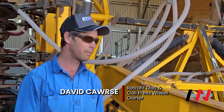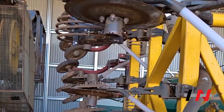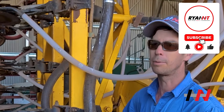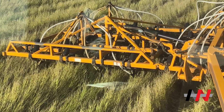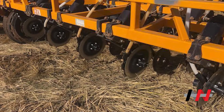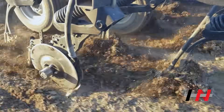We've got the AFM bar here on eight-inch spacings, and when we decided to retrofit the Rhine discs onto it, it was mainly for small seeds. But since then we've sowed lentils with it and a fair bit of barley and sometimes wheat, depending on stubble load. We can go into standing straw a little bit more than we can with the tow-on seeder, and we tend to get a little bit shallower placement if we want it.